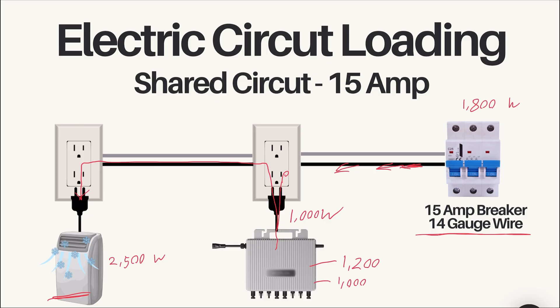We've got 1,000 watts from the microinverter — it can't power the full 2,500 watts, so the grid makes up the difference and provides 1,500 watts. But on the short wire segment between where the microinverter feeds in and the heavy load, those wires are carrying 2,500 watts — substantially more than the 1,800-watt rating. The breaker won't trip because it only sees 1,500 watts and has no idea there's an additional 1,000 watts fed in mid-circuit. That wire will melt, get hot, and potentially start a fire. That's why overloading a shared circuit is very dangerous.